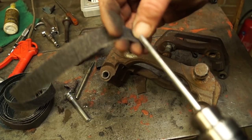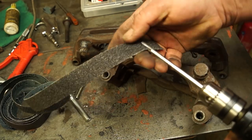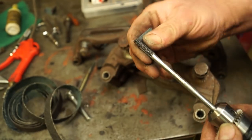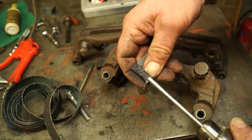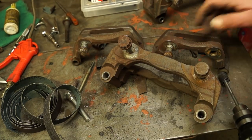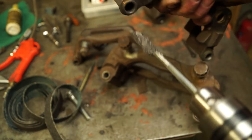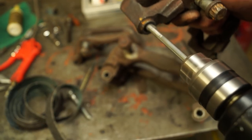Depending on what's in the bore determines how long the emery cloth lasts. We get emery cloth in rolls — it's very handy for buffing up metal. It doesn't take metal off; it just removes rust and surface contamination. With the coarse grade you can remove greasy rust as well. If you fashion a little pad on the end of the tool, it will clean the bottom of the bore out as well. It's as quick as that — the bore will be clean.